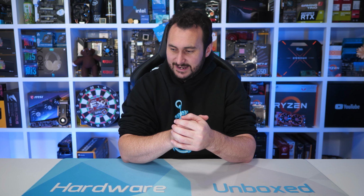Today I am finally going to go over our Intel B560 Motherboard VRM thermal data. It has taken me weeks to get all this testing done, and in total I've tested a dozen B560 motherboards priced between $80 and $150 US, using the Core i5-11400, Core i7-11700, Core i5-11600K, and the Core i9-11900K. It takes roughly an entire day to test just a single board, as many of these boards needed to be tested twice, so two different configurations, one using the out-of-the-box power limits and then another with the power limits maxed out.